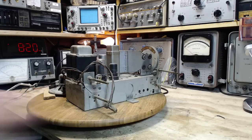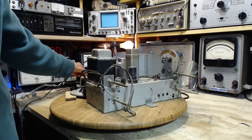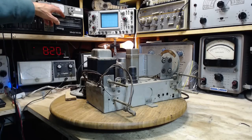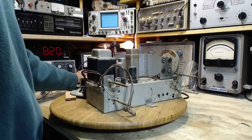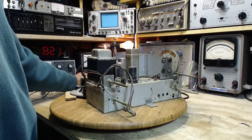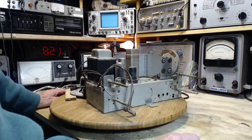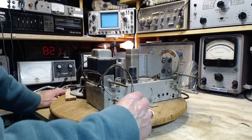So, I have some meters here that can help me assess what the voltage is, along with directly reading it. 65 volts to the radio. That's quite low for a radio. 65 volts. That's all I need to look at. How many watts is this thing drawing now? 30 watts. It's drawing roughly half what it's supposed to draw. So, I think it's doing what it's supposed to do. That's quite a draw for a little radio. I don't think we're going to hear anything at this voltage level.